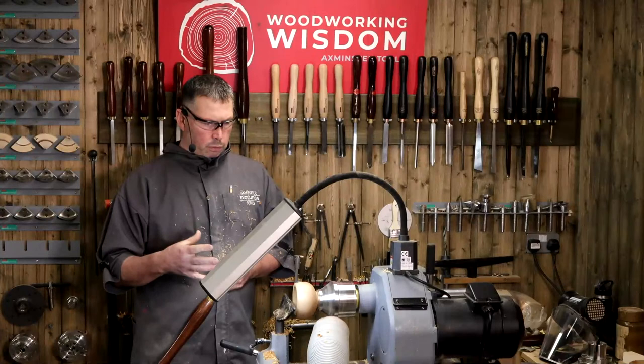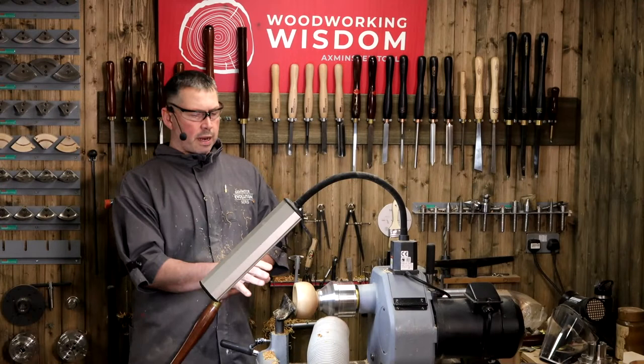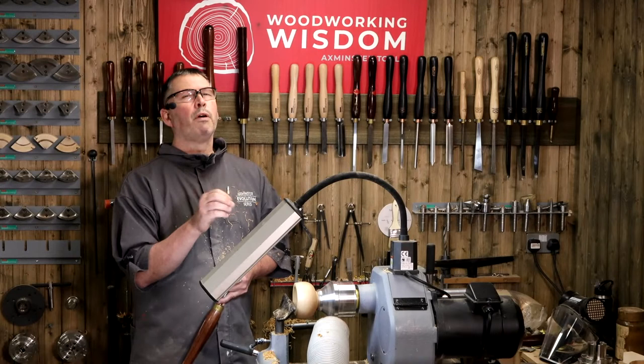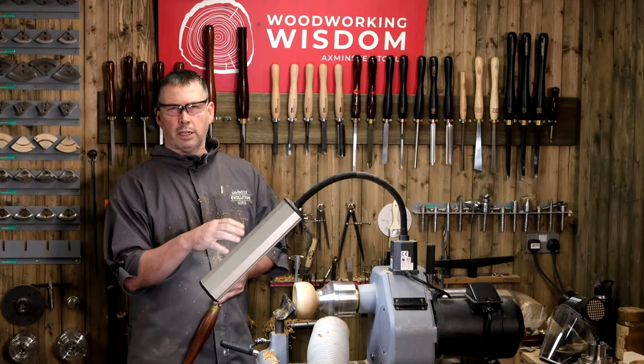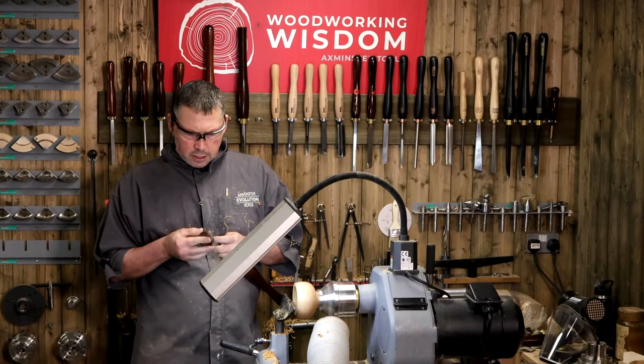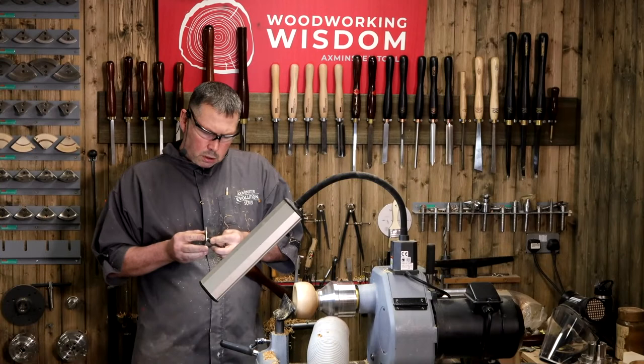I like these for the most part to stay the natural color. Sometimes I will brush them with vinegar and wire wool if I want them to go really dark, and that's a really cool look as well. Once you've done that, just give them a buff with some wax and maybe a brass brush, something like that, just to bring the grain out even more. But no, I've never fumed, really. I know Jason's done a little bit in our chess table. He fumed the chess board. But no, not myself.